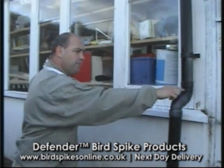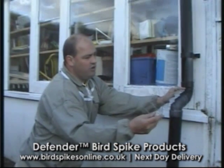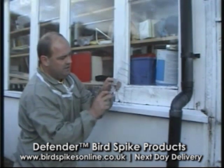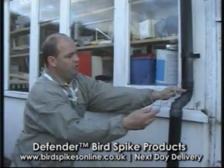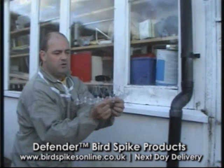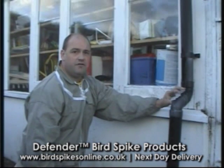Also, you'll notice here there's a piece of pipe work. Now that needs to be spiked as well. Here we look and we can see that that piece of spike is far too long. But if you look along the bottom, there's little snap-off grooves every 1 inch. So what I'm going to do is just put that on there. I can see that that's where I need to snap it off. And I'm just going to put that between my fingers, bend it backwards and forwards, and that snaps off. And now that is the perfect length for that piece of pipe.